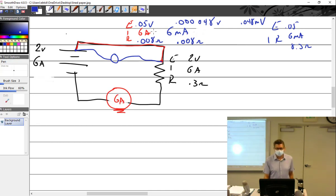See, what I did is I changed it so that we were running less amperage through it, but we assumed that the wire resistance stayed the same. Then what would that look like on a voltmeter? You wouldn't see it. When you get into tiny voltages, you don't notice this resistance in wires. But when you start adding more and more power, you see these resistances show up and have a huge effect. We could run 60 amps through it and the wire would just melt, so then it'd be an open. Isn't there a rule of thumb that you lose so much per foot of wire? Yeah. What is that rule of thumb?